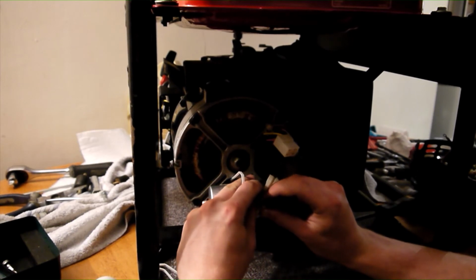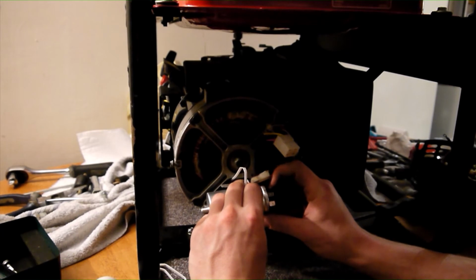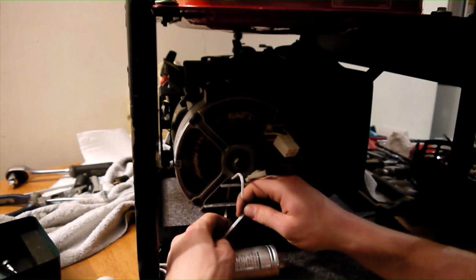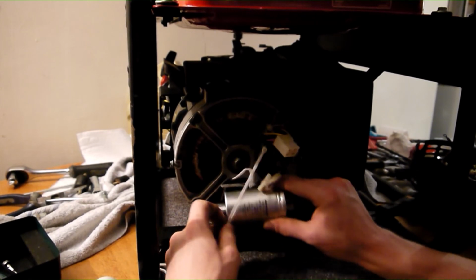As I found out in my case, the ties I'm using are not long enough to make it round the capacitor in one complete loop. In this case, I simply join two ties together to extend the length. Then I will use another set of ties to support the opposite end of the capacitor in a similar manner.